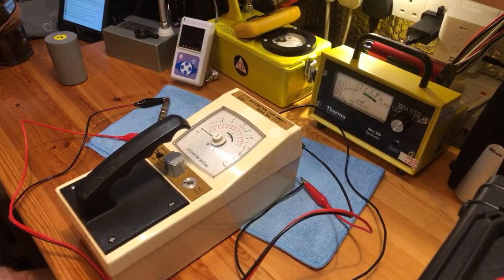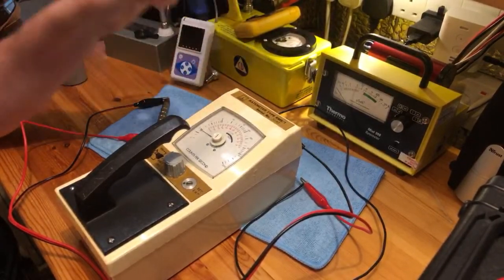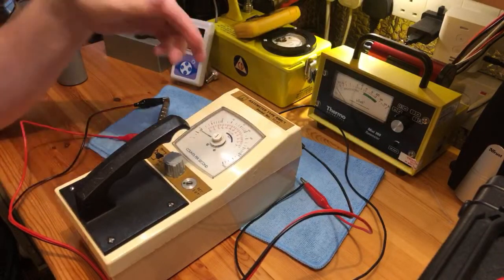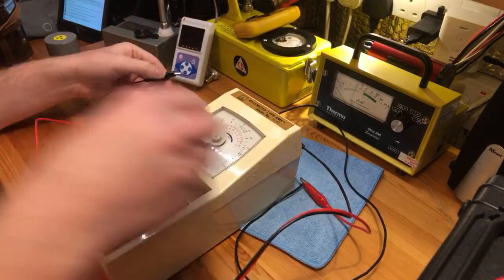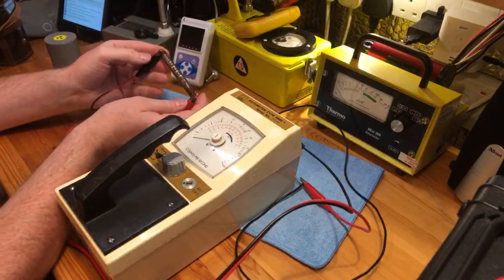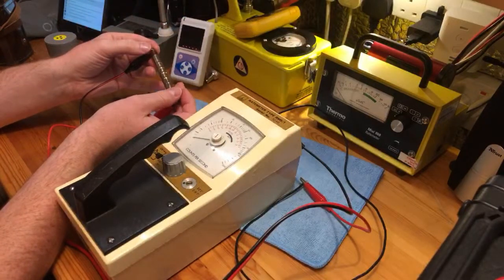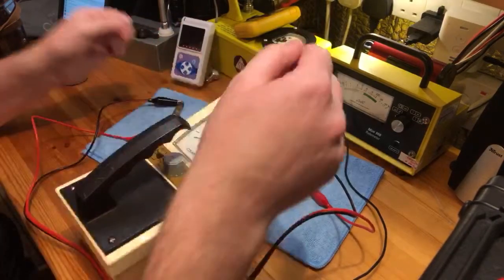BNC is the way to go — it's so much cheaper and easier. The PET-100 cables and connectors are just far too expensive. What I'm thinking of doing is fitting a BNC and then putting the tube inside some kind of plastic tube, hiding all the cables and soldering it properly so I have a neat external probe.